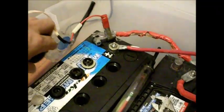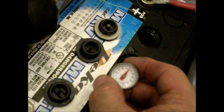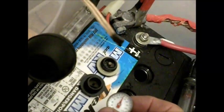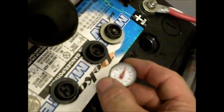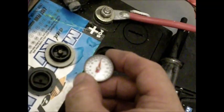I've been charging this since Friday. Friday was pretty much a joke — it's been raining. I've also been watching the bubbles come up, which right now it's not doing nothing, so they're not bubbling. Yesterday this one started to boil. Today it was boiling nicely. I've been using the temperature gauge. Yesterday I had to keep a good watch on it because it went up to about 142 degrees — it got pretty damn warm and I had to back it off. Today she's about 132. When it went over 140 and I had no bubbles, that's pretty much telling you that the dead cell is acting like a resistor. It's about 130, and that one there is about 126 — a few degrees cooler.